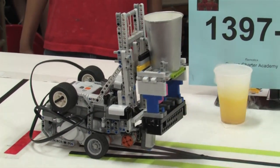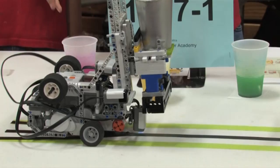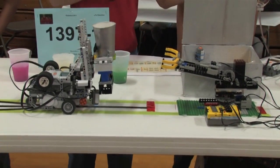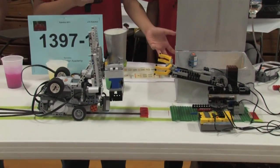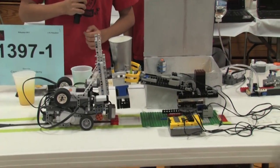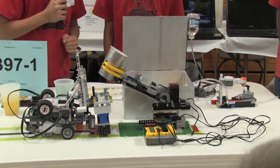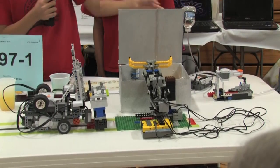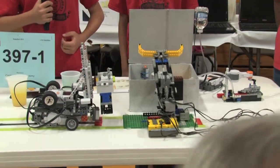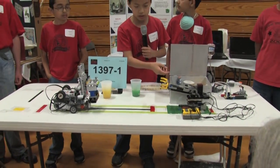Now I'll be talking about the safety zone and the arm. Our safety zone's lid just rose because the forklift sends a Bluetooth message to our safety zone, and the motor in our safety zone goes up. A touch sensor in the back stops it from breaking apart. The forklift continues forward following the black line, and at the red marker it lowers, and the infrared signal tells the crane to pick it up and drop it down. When the Bluetooth activates, a valve opens and water comes in for the cooling effect. Everything then reverses back, and a touch sensor stops the lid when it closes.